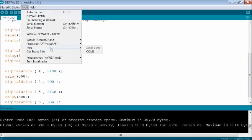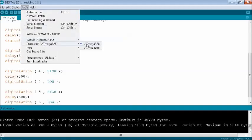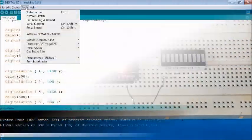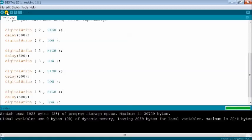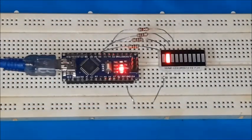Through the menu, set the board as Arduino Nano, the programmer as USBASP, and select the port for Arduino, which may not be recognized unless the USB cable is connected to your laptop or PC. Select the proper port from the list, then compile and upload the sketch. You may observe the output code is working properly.